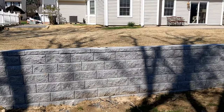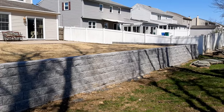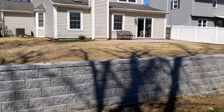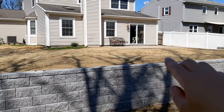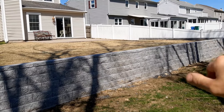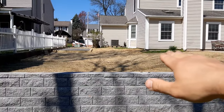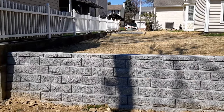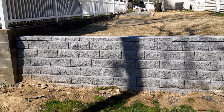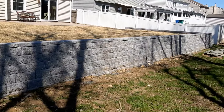Here's a view from down here — everything's filled in, we got our grass seed, fertilizer, and straw blankets down. Everything came out pretty good. You can see the grading goes down towards the wall and towards the corner where there's a catch basin that discharges through the wall. There's plenty of drainage behind the wall — a toe drain and a heel drain — and probably close to 24 inches of three-quarter stone behind the wall, so drainage is not going to be a problem.